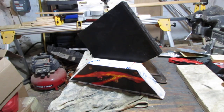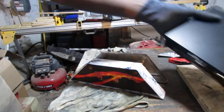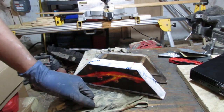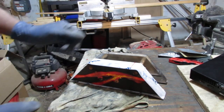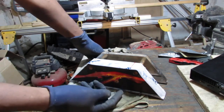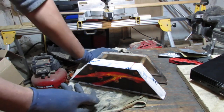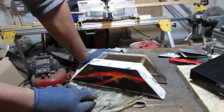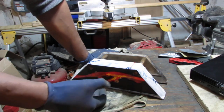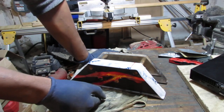Alright. Yeah, anyway, like I said, I've got to pour another layer of epoxy right in here to cover that up. Once I pour that, because these are holes, I don't want these holes to be unplugged, but I can't plug them with just any old thing. So I'm going to keep the dowel in there and pour it in here. It's going to grab the dowel and make it permanent, which is totally fine. We're at that point anyway.